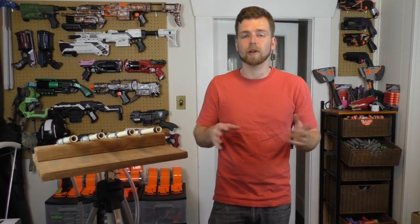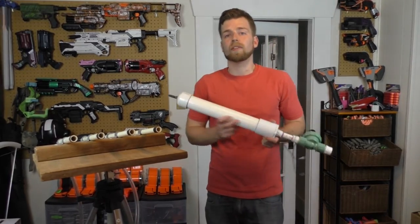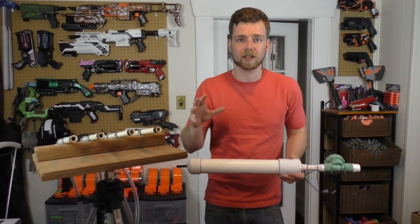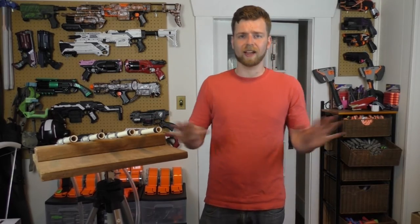After I created my first more mobile, bazooka-style air cannon, I wanted something more stationary. If you dig around in my Instagram you'll find a small video where I created a machine gun nest in my house — it had a Vulcan, and I had this thing set up so you could activate it in an emergency and fire off some missiles. I actually created another one of these for that purpose — this one is larger. I still take it up to about 40 psi to fire off the Nerf missiles, but the larger volume allows me to fire more projectiles. Higher pressure gives you faster projectiles; more air volume gives you more projectiles.